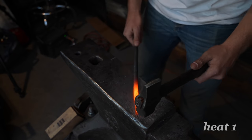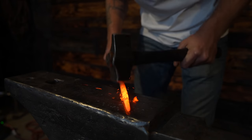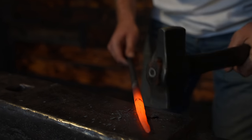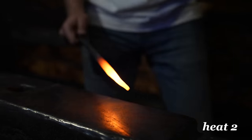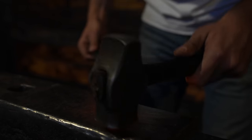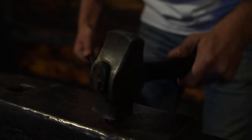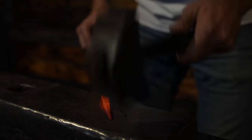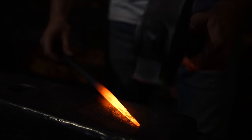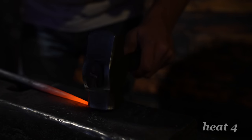As a responsible teacher, Brett instructed me to take a half-inch steel rod down to a taper — basically turning it into a steel spike. Doing this helped give me a feel for what the steel would do when I hit it with the hammer and how it would react before we went all-in on the knife blanks. One of the first lessons I learned was that being accurate was way better than being powerful. It was also a little weird having a working time — you could only hit the steel for as long as it was hot, like a shot clock in basketball.